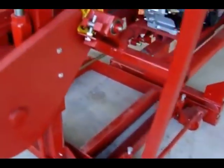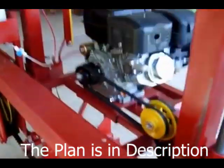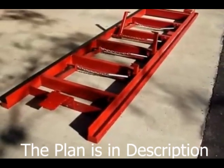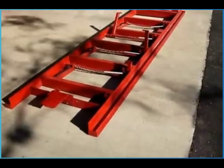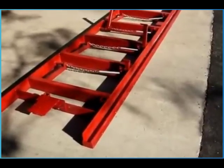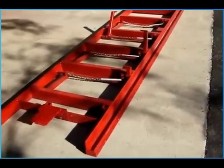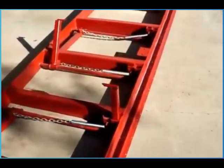Because mesquite is so rugged, the first part of the design is having a good sawdog system, and I like this system. It's a three-quarter inch galvanized pipe with a one-inch galvanized T welded to an inch-and-a-half 11-gauge square tubing, with a half-inch bar stock at the top that's been sharpened to dig in. I tap it in with a sledgehammer and hold it in place with a spring and chain setup. On the other side I have different length dogs to hold it in and keep it properly positioned close to the blade.